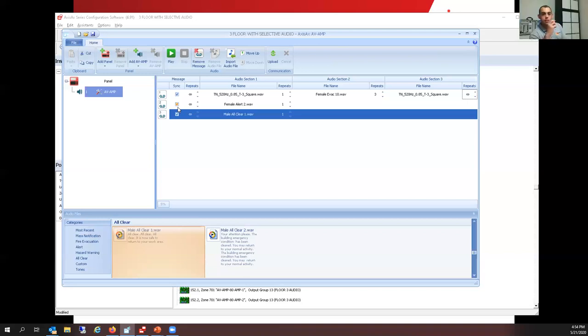Hey, Greg. Then you're saying there's one power supply for two amps? In that case, yes, you could use one power supply for two amps. Now, if you think about it, it's an 80-watt amplifier, and if you're doing backup, the second 40-watt amp never does anything. So you're only using 40 watts worth of the power. That's why you can double up amplifiers: 40 from this amplifier, 40 from that. That's 80 watts. You're never overloading. Okay.